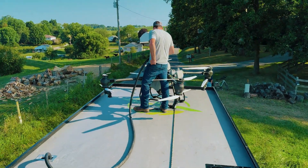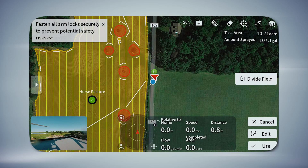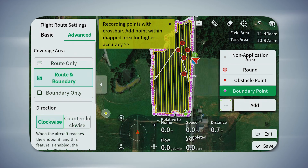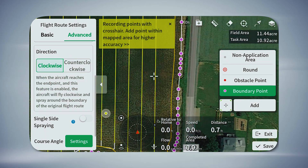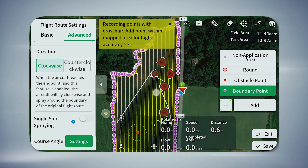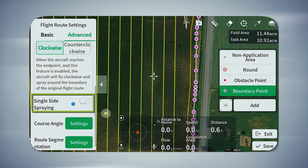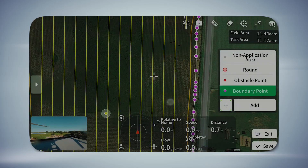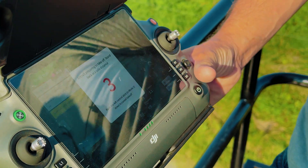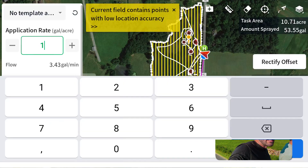Mix is done, Jay's filling the first drone. We've picked our boundary area — you can see the obstacles. We're going to spray the boundary. That orange line in this area: it's going to first spray all the yellow area, then it's going to do an auto boundary and the drone will fly around the edge. We save the parameters — 10 gallons per acre, 30-foot swath, 9-foot high — and the drone is going to go out and do it all on its own.